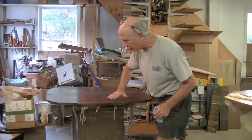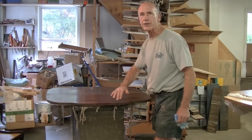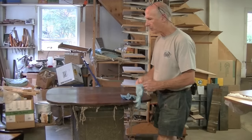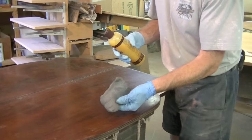Okay, I've let the shellac dry just for a couple hours, and I'm not going to put any more on. I just wanted to seal in the staining and what I did. And so now I am going to go over this top with the beeswax polish and some steel wool. This is 4-0 steel wool,